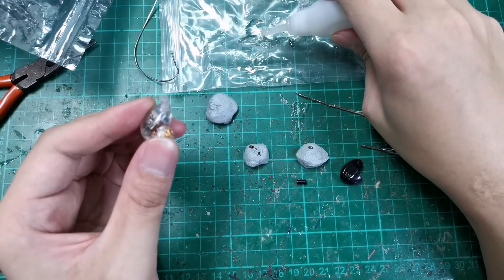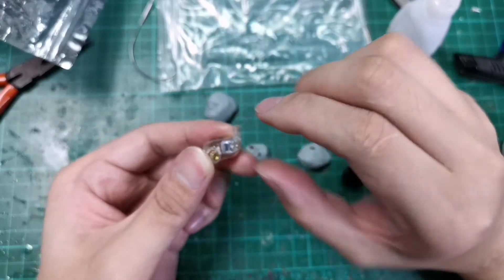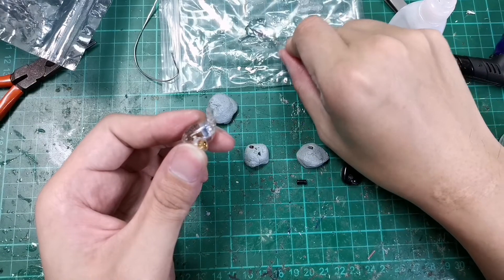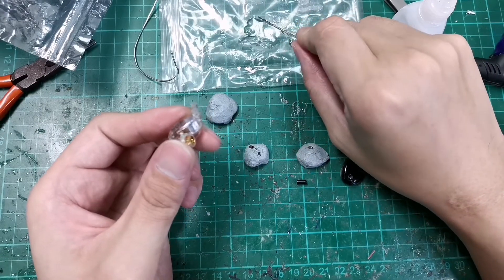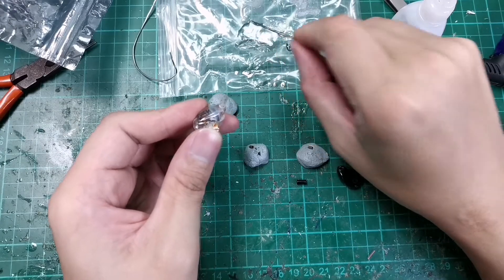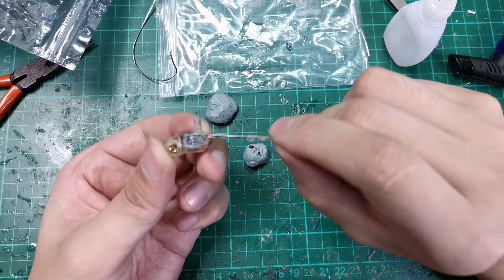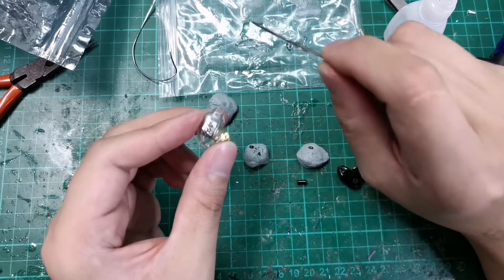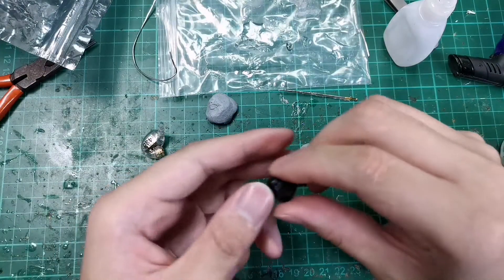CA glue, super glue — they work best when the two parts are in contact. When the two parts are in contact, you let it sit in the gap; they work best this way because with the absence of air the glue doesn't oxidize and forms a very good bond. So what we'll do: take a needle and let it drip into the crack. I'm using 502, so it's very watery and takes some time to dry. So we have time to work on the other side.